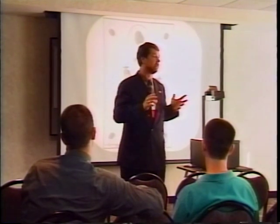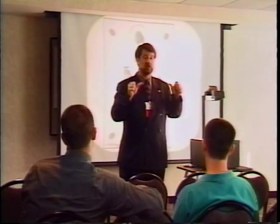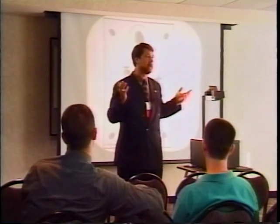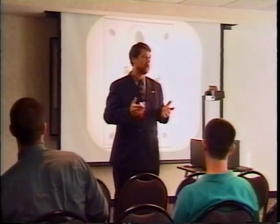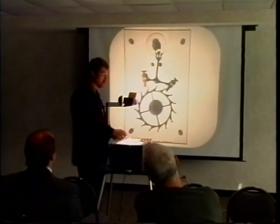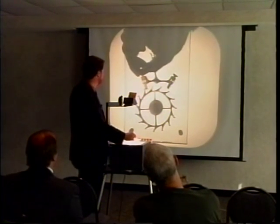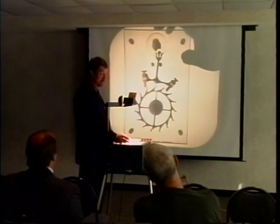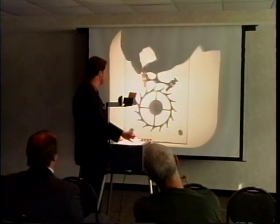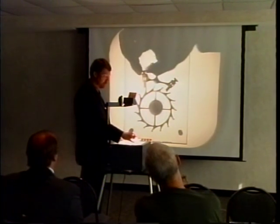And the idea is if you're being real concerned about the efficiency of the escapement, then you back your locks off, your total lock off as much as you possibly can so that you still have safe. And that's the best that escapement's going to operate. It's not going to get any better. So I never understood, if you had a pallet stone that you felt had a little bit of lock that was too much on one side and you pushed it in, what the effect was going to be on the opposite stone, because I just don't think that way. But since it is on the test...